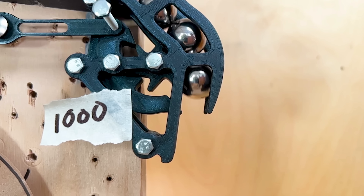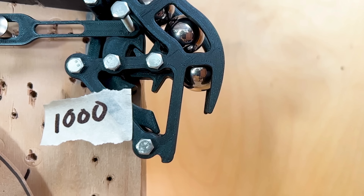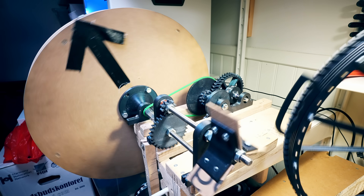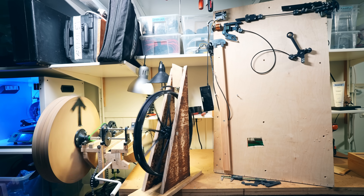So far I've designed this marble gate prototype that can drop marbles with very precise timing. Next I found out that I can use this Huygen drive to rotate a shaft with very precise speed. Now I want to connect the Huygen drive to the marble gate through this new programming wheel prototype.